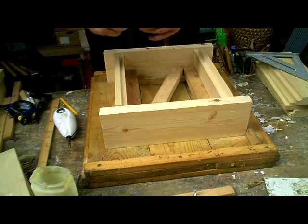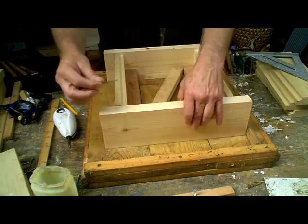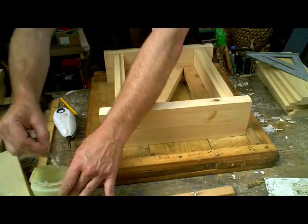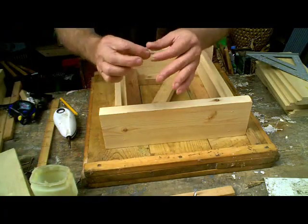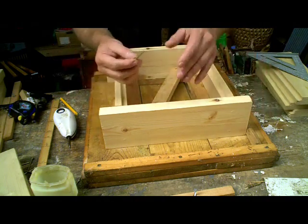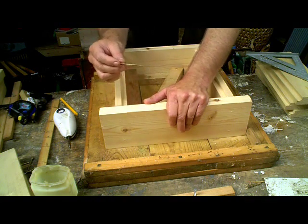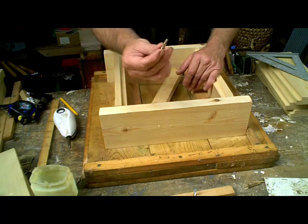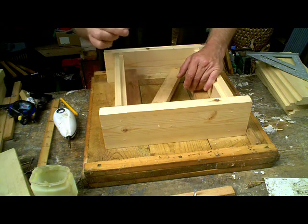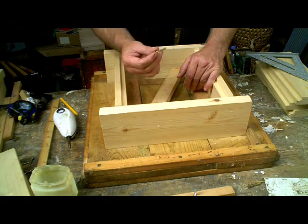One little trick I'd like to show you: when you're driving a screw — this is a long plated screw going straight through the ends into the end grain of the side sections — if you apply a little grease, in this case Vaseline, a petroleum jelly, you can also make something similar and possibly more bee-friendly using a little beeswax melted into some linseed oil or another vegetable oil. If you coat the screw thread with this and drive it in, you'll find two things happen: one, the screw will go in really easily, and two, it will take much longer before it starts to deteriorate inside the wood due to rust.